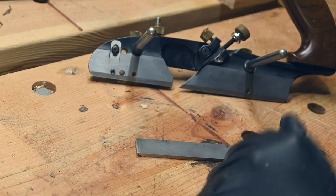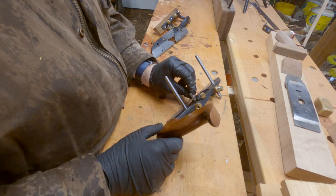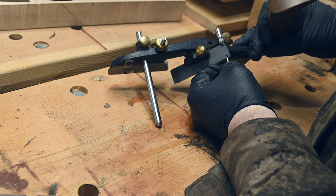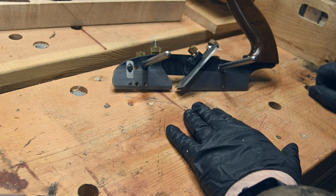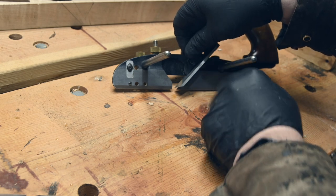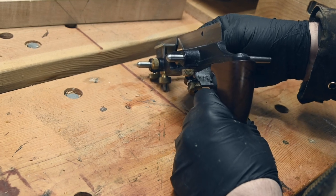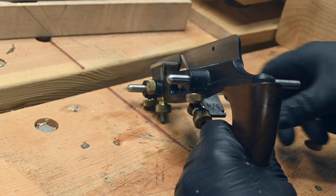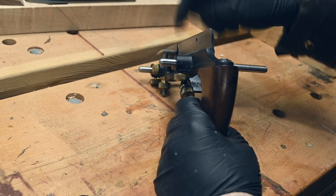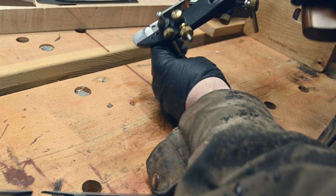So that's the right hand shoe. The blade simply drops in and hooks into this registration on the depth adjuster. This is a bevel down arrangement. We drop the blade in and then tighten down the blade holder. Then we can turn it over and check the width offset of the blade. As you can see, there is the teeniest edge of the blade showing beyond the edge of the shoe — that is a good adjustment, so we don't need to adjust this screw.